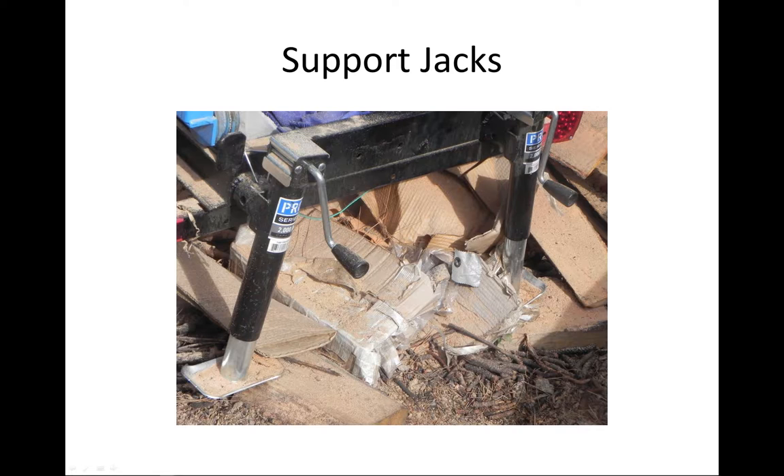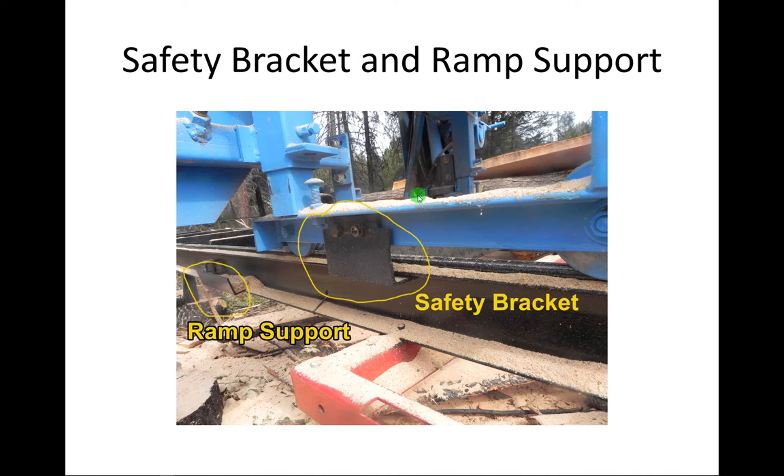Those are the necessities — something that absolutely has to be done. Next: the sawmill rides on the frame, on the channel, and is not attached in any way, shape, or form. I felt very uncomfortable about that. It's a 400 to 500 pound unit that may slip and fall — that's really not safe. So we installed two brackets, just steel angles with bolts, one on each side. It took a little tweaking to make sure they don't touch the rail underneath, but now the sawmill is safe to operate and will not fall on you.